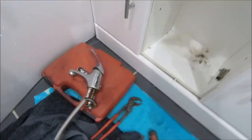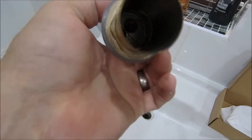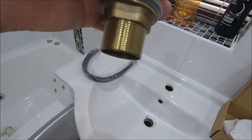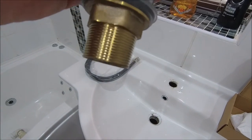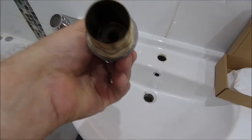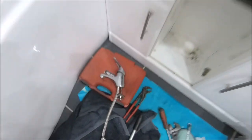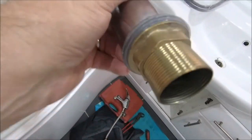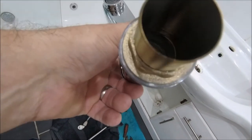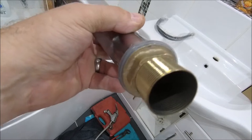Now, if I bring you the new tap, let's come up here. This has got what looks like a bit of 32. I might have a socket that will go over that, but I haven't got a long reach one. So what I might need is a right angle plumbing spanner. Now I've got to go out and get a new waste anyway, but I wanted to get this sort of mocked up because again, if you look at that one, it's very different the way the pipes go in there to where they're hidden away right down there, which is not brilliant to be honest. It's going to be really difficult to get a spanner in there to tighten the damn things up. So that's a pretty naff design, to be honest. But it is what it is.